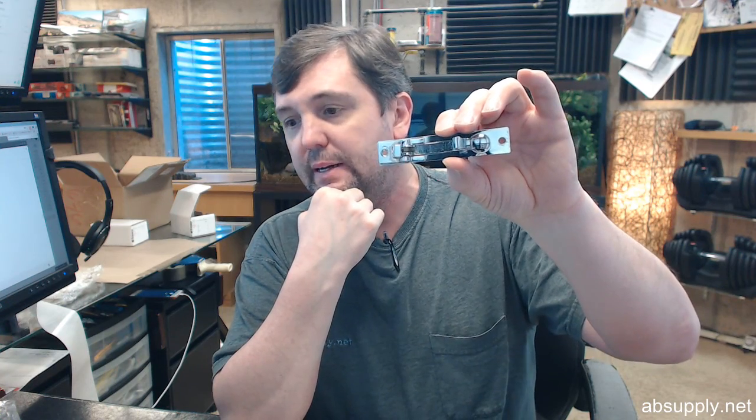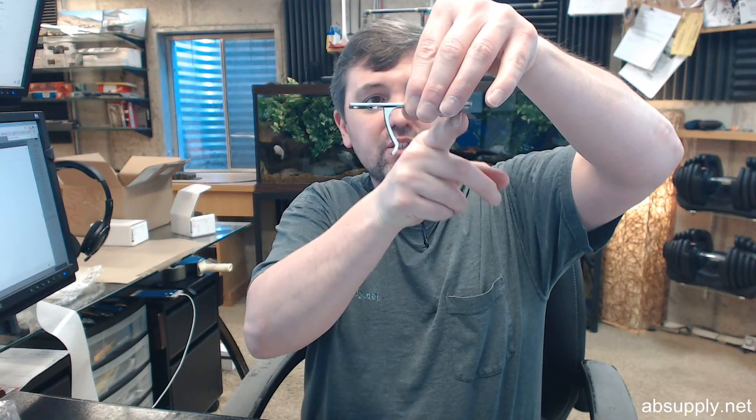And I find a woodworker's best friend is really the caliper rather than the router. I like to use the caliper so that I can accurately gauge the physical dimensions of the piece of hardware. If I have one and I'm going to use it as a template by which to machine the door, I would, because those dimensions aren't given on the piece of hardware directly, I would measure the actual piece. Now, you could certainly ascertain that your prep is going to be, you're going to do 2 preparations. You'll do a body prep, which will be all the material that has to go down into the unit itself.